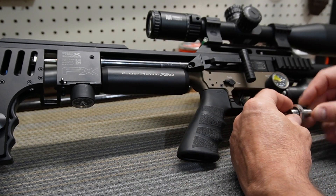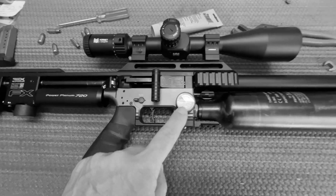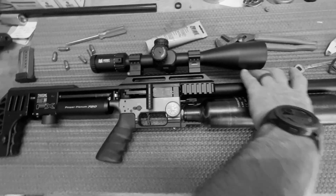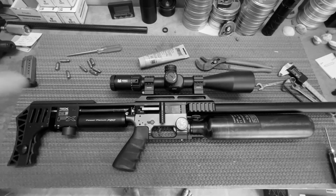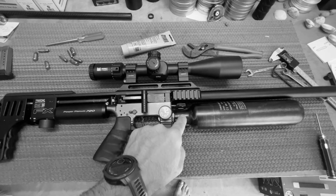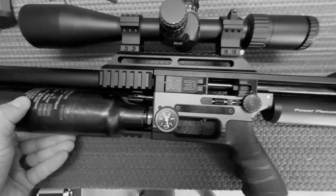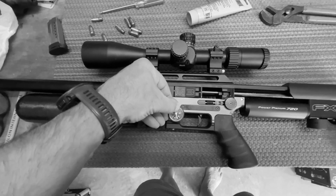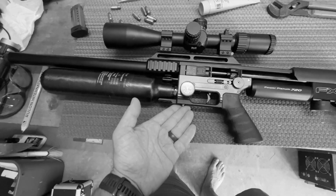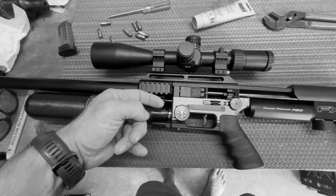I do believe I don't need this regulator because it's actually causing problems. Here's what happens when I pump air into the cylinder: my main regulator looks normal, but let's look at the first-stage regulator — isn't that crazy? The first regulator is set to 170 bar, but when I fill the bottle it spikes all the way up to match the bottle pressure. After shooting about half a bottle it settles back down to 170 and stays there, but every other fill-up it does this — goes all the way to bottle pressure.